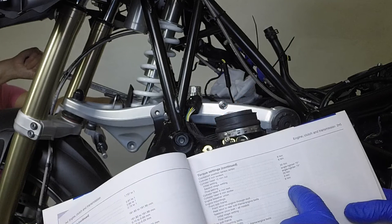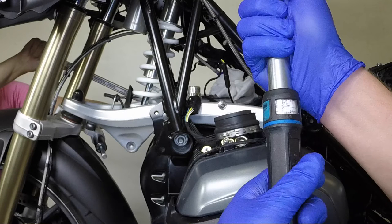The manufacturer applies a measured torque to a bolt or nut to ensure that it will not slacken in use and to hold two components securely together without movement in the joint. The actual torque setting depends on the thread size, bolt or nut material, and the composition of the components being held. Too little torque may cause the fastener to loosen due to vibration, whereas too much torque will distort the joint faces of the component or cause the fastener to shear.